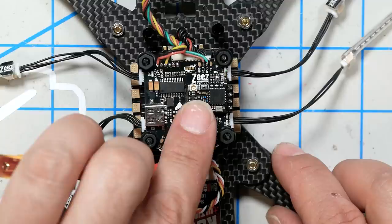As I was soldering it up, you've really got to think beforehand to make sure you're going to have the number of UARTs and pads you need. It says on the spec sheet it has six available UARTs, and that's probably true. But some of the UARTs are covered up by the receiver. Some of them it's like a TX here and maybe an RX there or maybe camera control. From looking at the pad layout, it doesn't feel like you actually have six full UARTs — you've got a TX for smart audio, you've got an RX for smart port. So think very carefully about how you're going to do your wiring diagram before you commit to this. If what you've got is Crossfire, Unify Nano, and camera, it's going to go together really well if you're up to it. This is pros only, and only if you are 100% sure it's what you need.